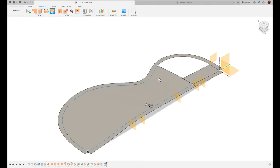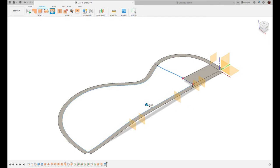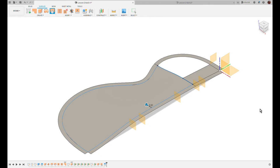So if you ask Fusion 360 to loft this surface tangent, you will end up with some small ridges, and believe me, you will not see them in the software, but on the wood you'll see them. And I had to restart a mold from zero, and it's very long and frustrating. So don't make this mistake. So just use the rail over there and this part. Okay. So now we have a nice surface that goes from there to there.